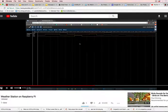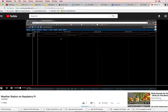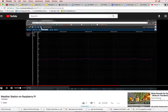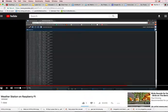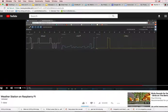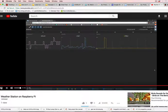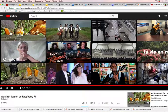It would have been fun, not for people in the storm, obviously, but it'd be fun next time you get this running and there's a bad storm, you're able to track what the pressure is doing. You're going to find that when storms come through, for the most part, there's a lowering of pressure as a general rule. Okay? But this was just done with your Raspberry Pi. So you didn't realize it, but you already have a weather station now. All right.